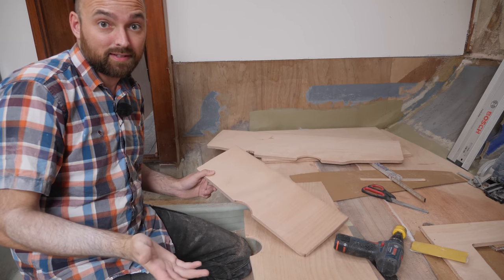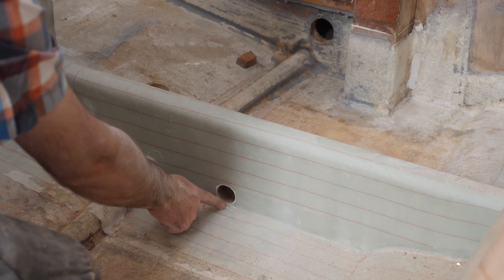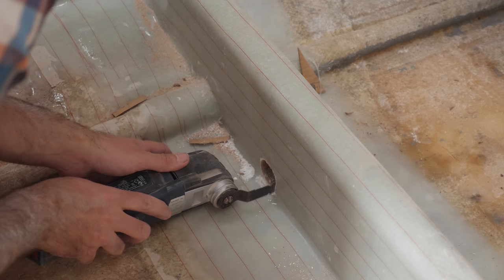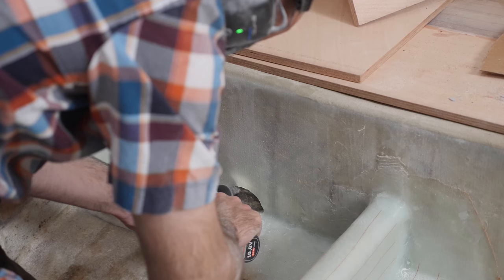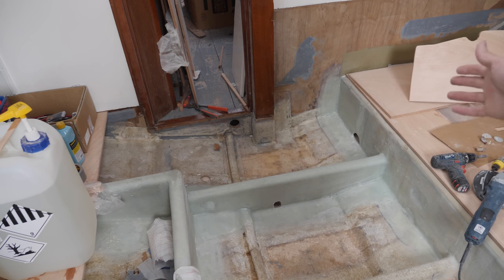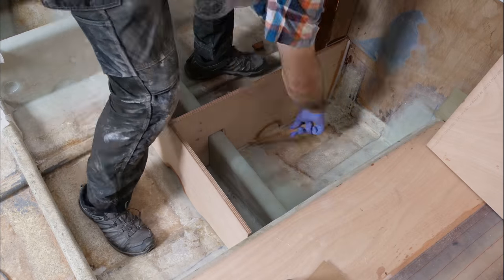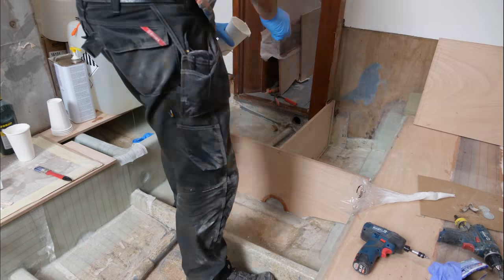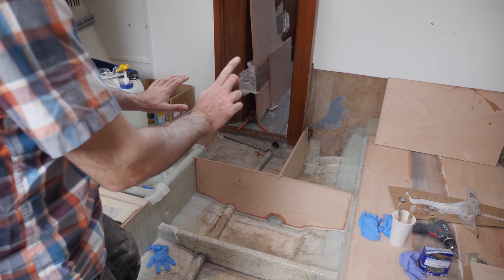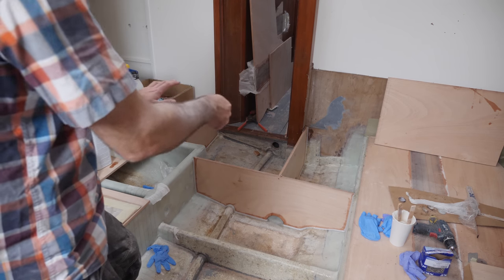I can also improve this hole a little bit, because right now there is about a 5mm lip down here — if I cut this down so it's flush with the tabbing, then more water would be able to drain. I've got the limber holes taken care of and I've prepped the surface, so I might as well see if I can get those pieces of plywood adhered to the boat. For a brief but foolish second I considered tabbing all of this tonight too, but I think that's gonna be a lot easier tomorrow once the fillets have cured and I can push in on the plywood to air out the laminate.